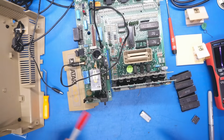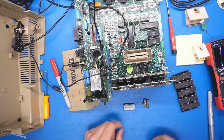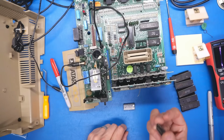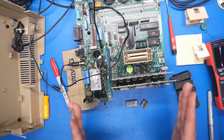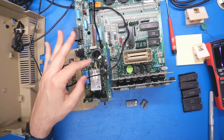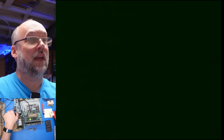Okay, so what do we have so far? We have a questionable ROM and 2 RAM chips that seem bad. It's questionable whether these are really bad because again, the tester told us they were bad, not the system. So these might be fine. But this ROM, that could really explain what's going on. So I'm going to leave that ROM out. Let's turn on the system like this and just see what happens. Okay, turn on the VCR and, same kind of thing. Rolling picture.